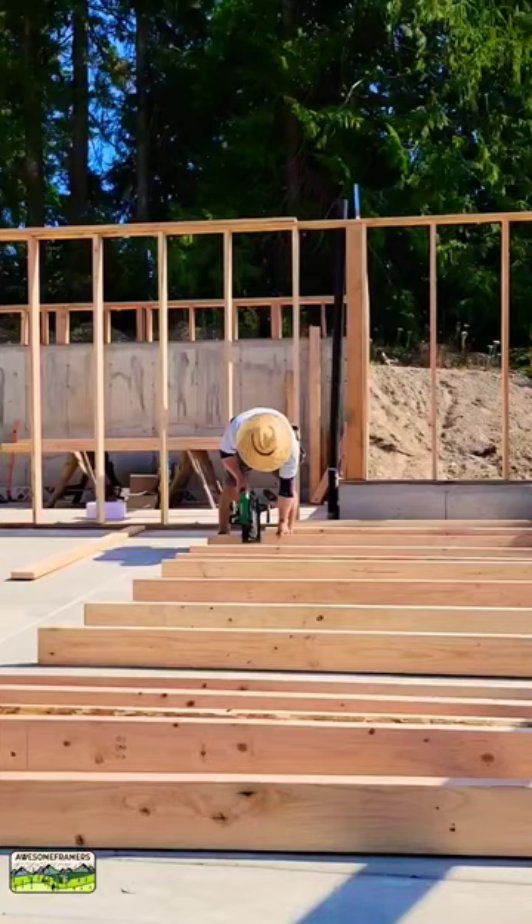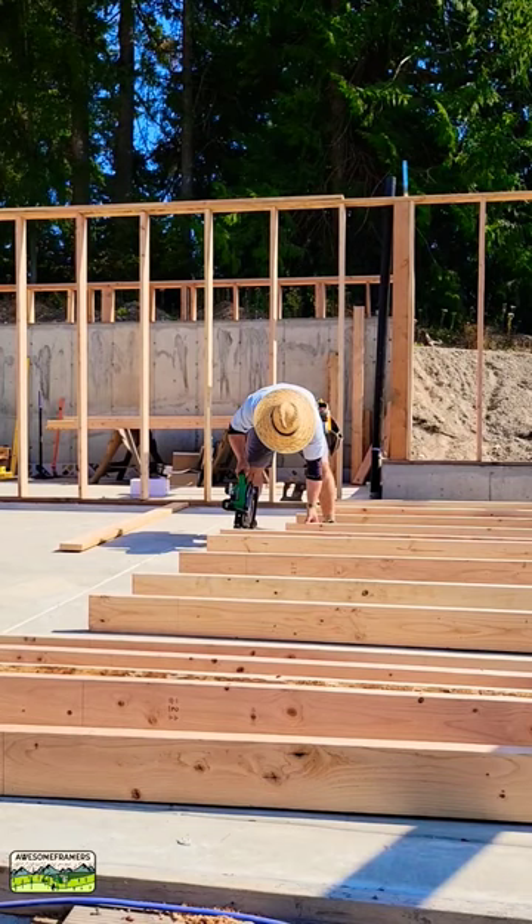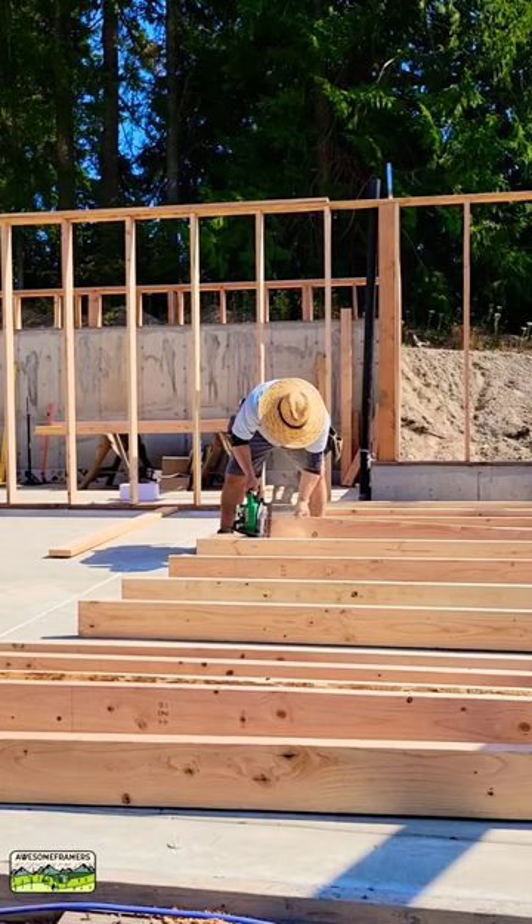If it's longer than 25 feet, then shoot a laser on a stud in the middle — that's going to keep us nice and flat. Cut them as you go, and throw the scrap away so you're not tripping on it. That's it — the idiot's way to get perfectly flat top plates.